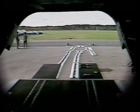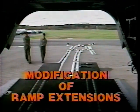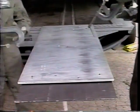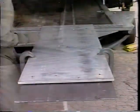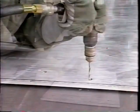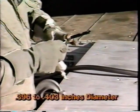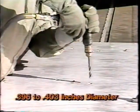Before installing the system, carry out the following steps on both ramp extensions to modify them if they have not been modified. Place the master drill fixture over the ramp extension so that the alignment pins are snug against the ramp extension. Use at least two C-clamps to hold the fixture in position. Using the drill fixture guide holes, drill six starter holes, and then proceed to drill larger holes between 0.396 and 0.403 inches in diameter through both sides of the extensions.